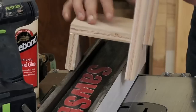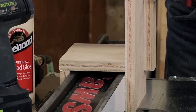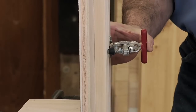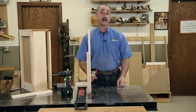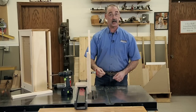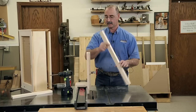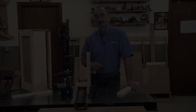The way this is going to work is that it goes on our fence. Our material will go vertically in the jig, we'll clamp it in place using the toggle clamp, then we can feed it very safely and easily over the saw blade to do tenons or half lap joints. It works really well, and as you can see, it's very simple to put together — a great addition to have for your table saw.